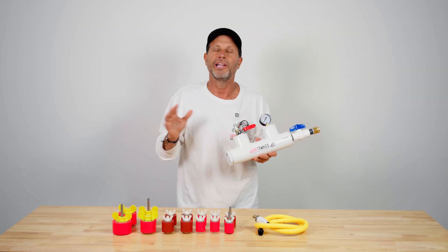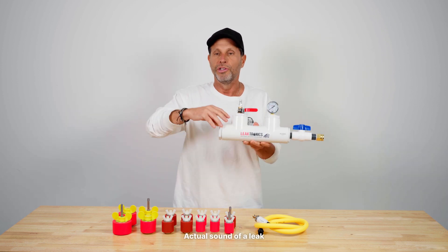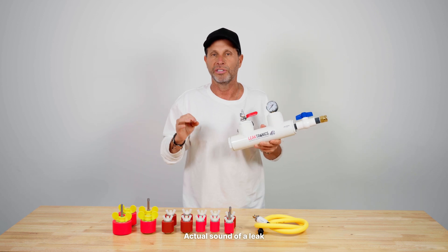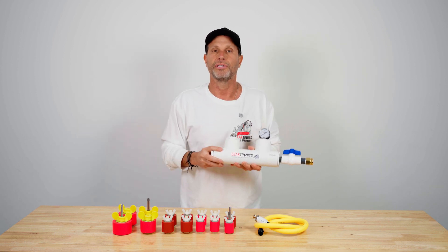You're listening for nothing like what you heard with our hydrophones — you're listening for the boil. With water, you're building pressure and trying to pull that water around the pipe, and when you give it a burst of air, it's going to create that very distinct boiling sound. That's how we use a pressure rig to find those leaks.